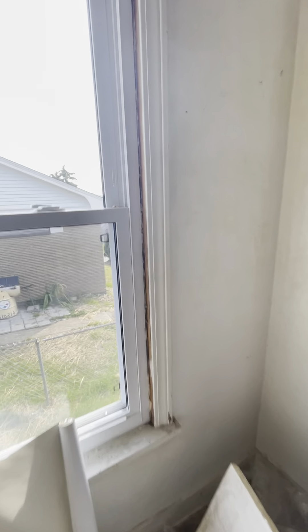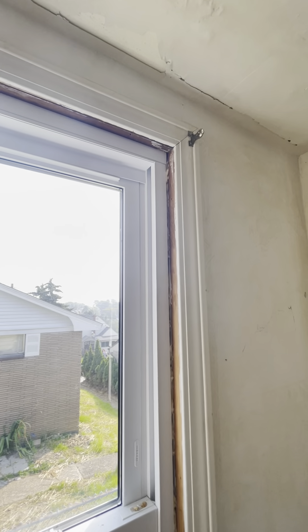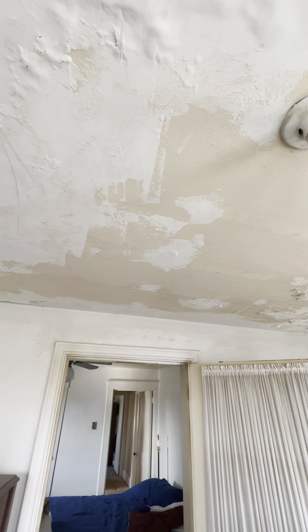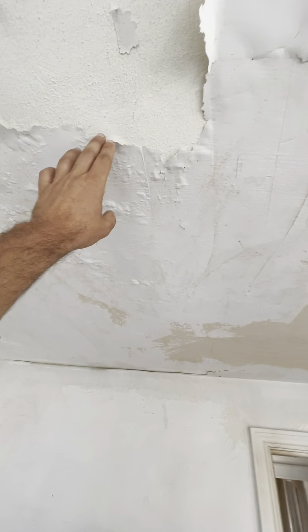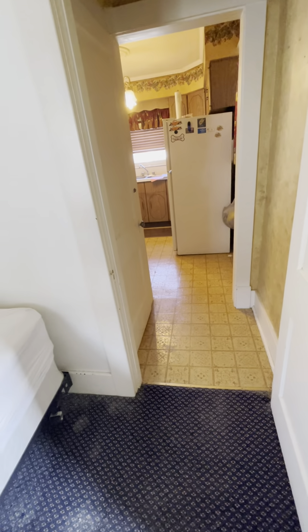All these windows are good. We have a bunch of stop at the office — we're just going to add to here to finish it off with some type of trim. We'll leave all the casing intact. That door can stay, we'll just paint it. This ceiling needs a lot of love — probably scrape it, mud it. If you can get it back to original texture, great; otherwise just do a quick stipple knockdown.